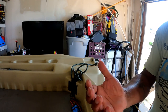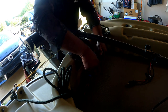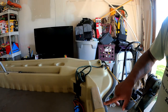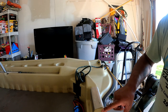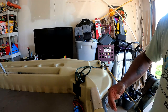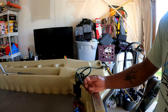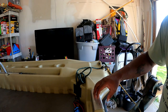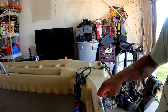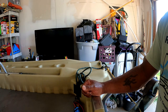It would cause the motor to slip, so I started tightening down on the knobs to secure the trolling motor better. What happened was the front transom became warped. I'm not sure exactly what material is underneath the boat in the hull that gives the transom its shape — I imagine it's some type of wood — and that made it rough to keep a trolling motor on the boat. I said, this metal is way too thin; the back transom is the same thickness metal they should have put on the front.